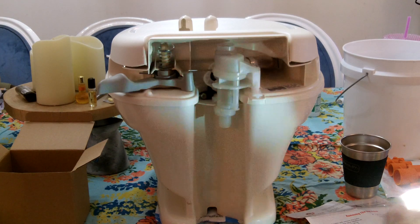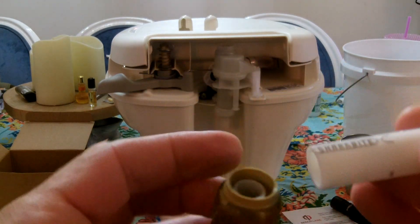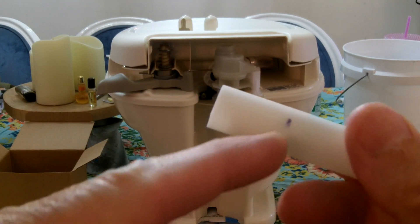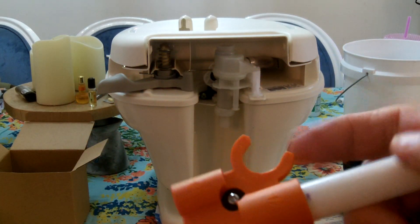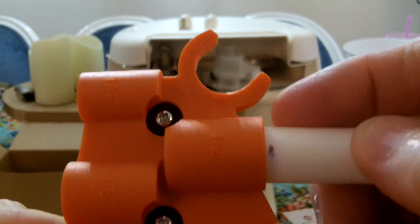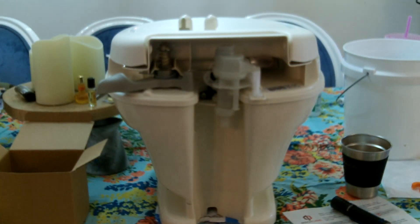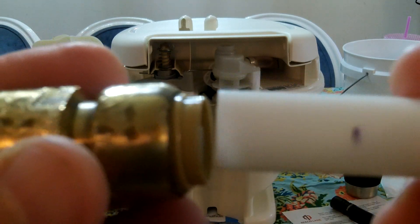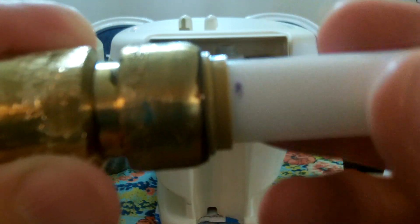My half-inch PEX pipe goes in there. You take the piece of PEX pipe and fit it in — you measure first with the depth finder, which is right here. I picked up a couple of things from Amazon today. For half-inch PEX pipe, you put this in, line them up, and make a mark so you know how much to push the pipe. The depth of the pipe has to make it all the way to the washer inside the SharkBite — you don't want to put it in too little. You push it in and it should go all the way down to the line, and that's fully seated.